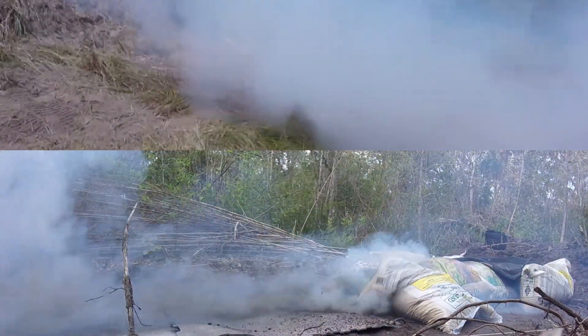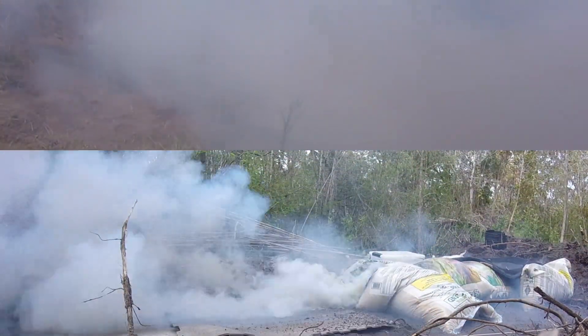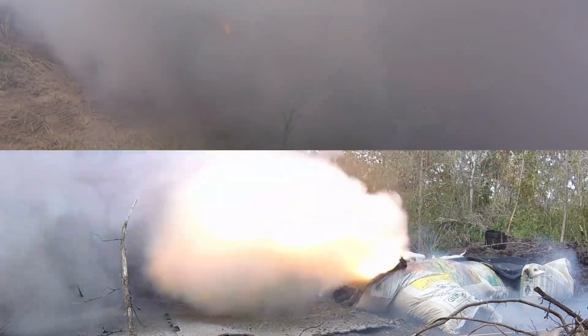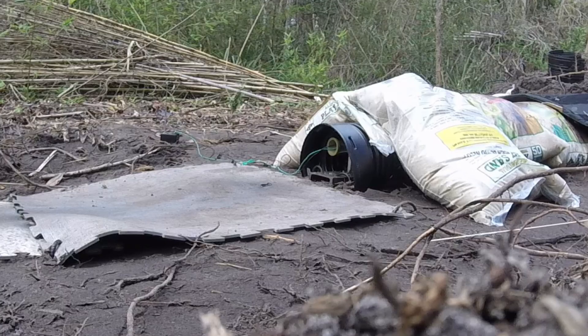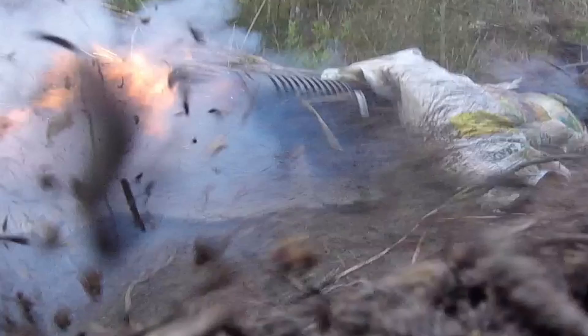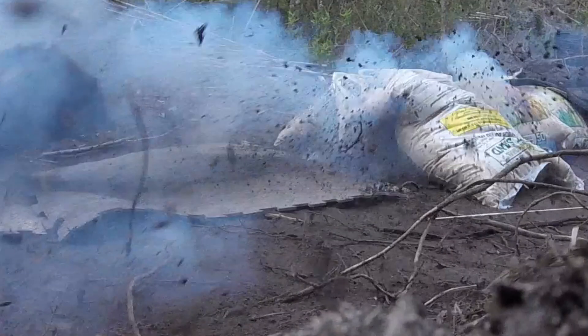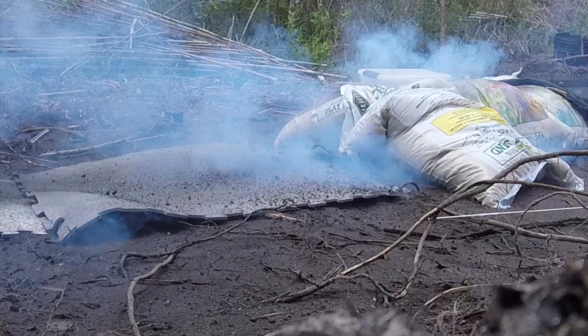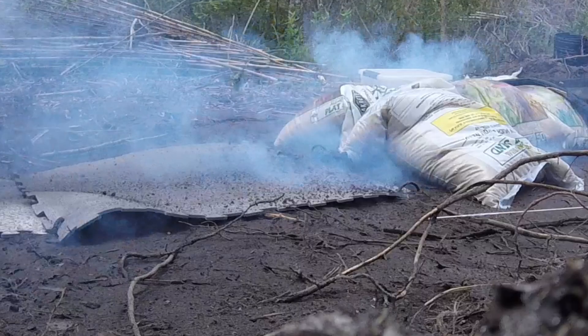The new motor technically lasted a few milliseconds more than the previous motor. What's interesting is that the black in the initial burning is the inhibitor, and it technically does work, slowly improving the peak pressure. However, once that burns away the motor starts to chain-react and then explodes.